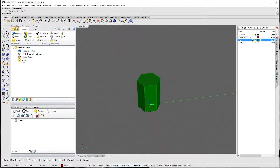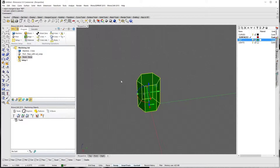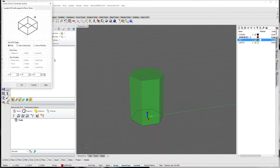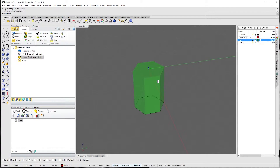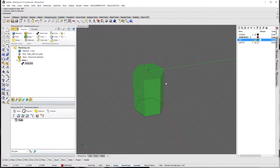Let's get started setting up the machining job. Let's add stock — I'm going to right-click stock and do stock from selection. I needed to select it first, so hit okay, select that piece, right-click stock from selection. If I turn off that reference layer but turn on my stock, you can see it's right there. As usual, we're going to set our world coordinate — set to stock box, center on it, highest Z, so we're right at the top. Hit okay. That moves it down just how we want it, and we're going to touch off the top of the part. Then come down to set up and add a work zero — stock box, highest Z, center — and output a work offset of G54.